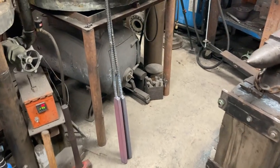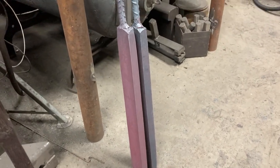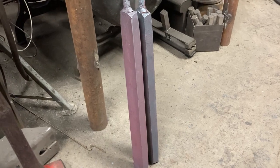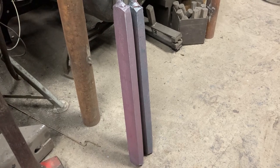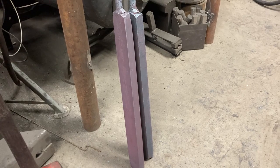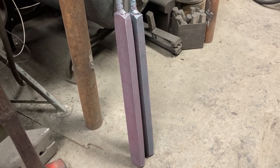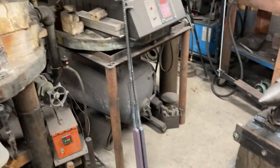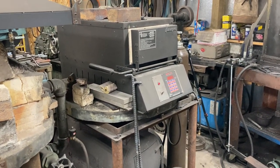The forge is cooling down — I'm done forging this. Both bars have been run through the rolling mill at the same roller height, so they should play well together. After I get them annealed and then chop the ends off and check the pattern, I'm going to do a DET anneal. I'll talk about that a little bit more while I'm showing them getting put in the kiln — we'll go through programming that.